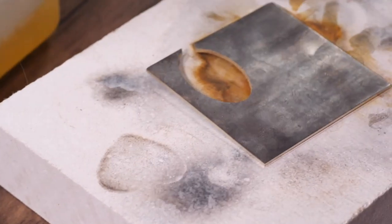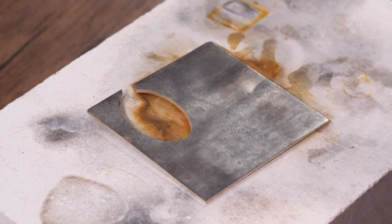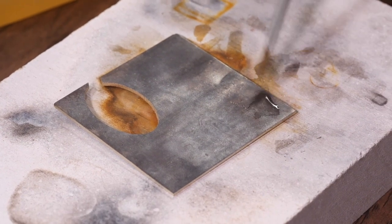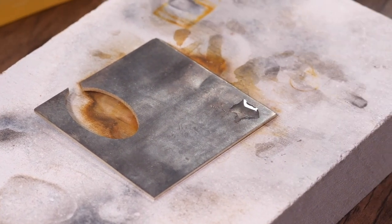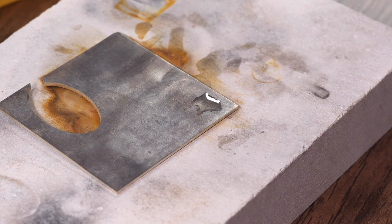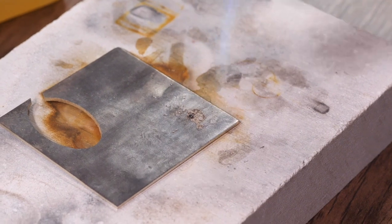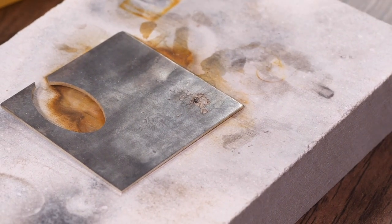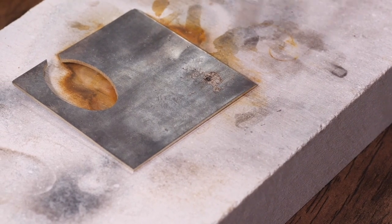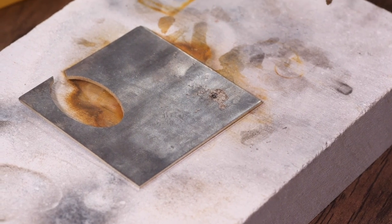Let's have a look at it on metal. I'm just going to open up the liquid flux and start with that one. Pop a little bit on my brush and place it onto the metal so you see the liquid come out. And then if I put some heat on it with my torch, we'll see some little bubbles start to form. And just bubble it up — that's what flux looks like once it's on. So it's just kind of a little splatter of white stuff. That is how you know that you've fluxed the area — pop your solder on and follow through the process of soldering.